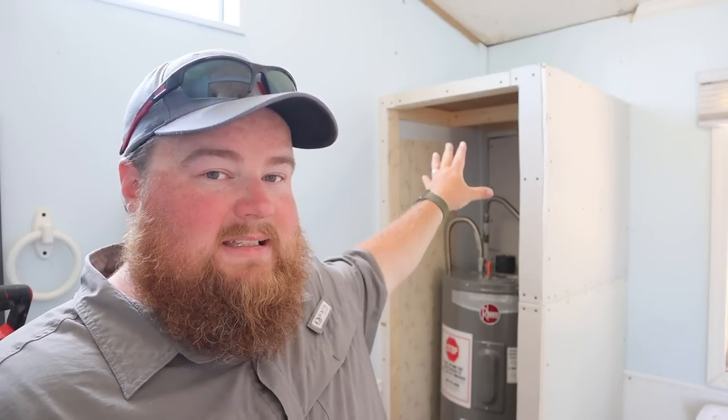I added some additional support structures on the ceiling of this box so that if Angel needs to store anything such as linens or things like that, we can do that safely with no problem. I still left plenty of height inside here for any kind of future-proof needs. While this is an electric heater and those don't generate heat or need any kind of ventilation per se, it will have it with the door that we'll end up putting on here, and it has plenty of room inside as well to not be an issue safety-wise.